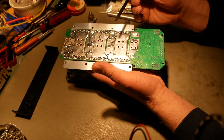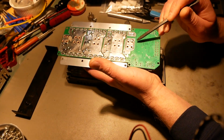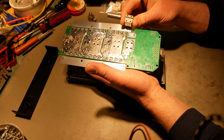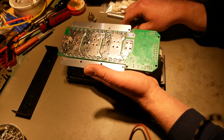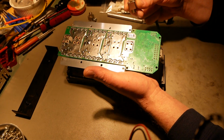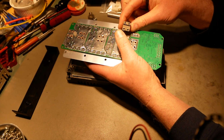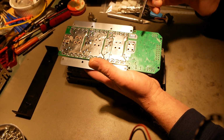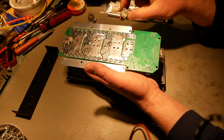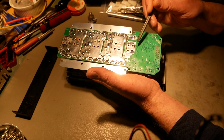All right, this right here is, as you can see, a 2 millimeter thick piece of copper on there, and you can see the 4 through holes in it, and those thread right through that copper right to here. So it's a pretty solid current path, and they're using the screws as part of the current path to get from here to the actual standoff. So that's really good. And it's also got those large areas of surface on here that stick down to the circuit traces on the other side, which have lots of vias in them. So this is a pretty solid current path from the standoff to here. And like I said, that's battery minus.